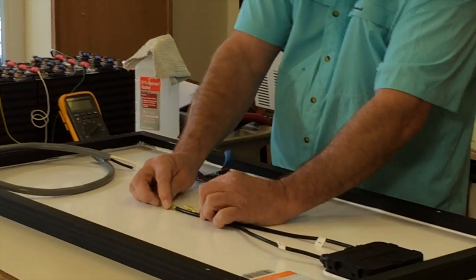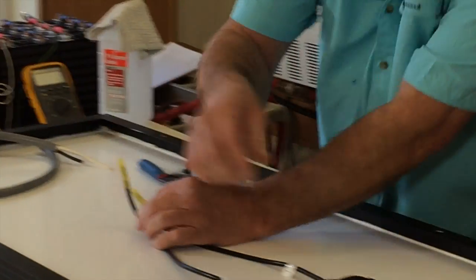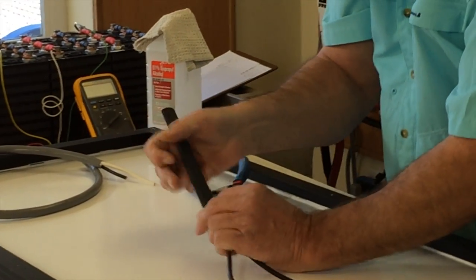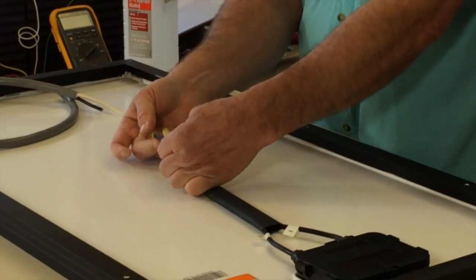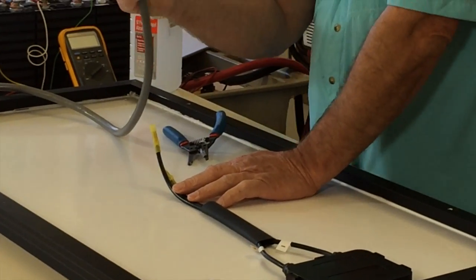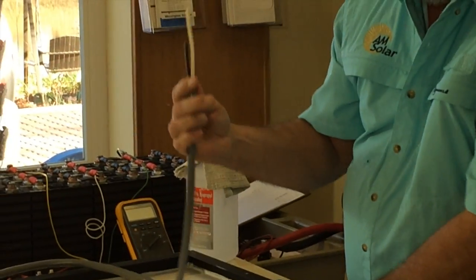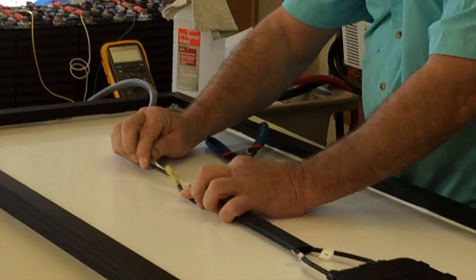Now when you lay these out you'll see they're laying next to each other. If they were cut the same length they'd be side by side, creating a knot in the middle. We're going to slide another piece of glue-filled shrink tube over here — always put your shrink tube on before you make your final connections because it won't go on otherwise. We're using black and white conductors: black is positive, white is negative. Since our positive cable is slightly longer, now you can start to see why we did what we did.